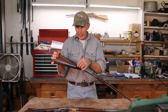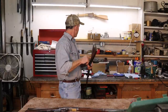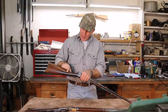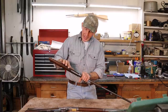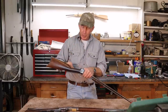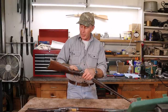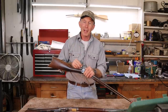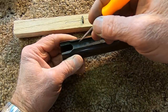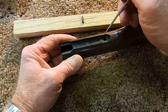One side of the crack was slightly higher than the other because of some old resin in there, so we had to go back and wet sand with Timberlux - that's a fairly new finishing product I've really fallen in love with. I just wet sanded with the Timberlux, took that high edge off, and really matched it up well. So that's an overview of how we closed up that crack, reinforced it, and then blended it in. Then we did one coat hand finish of Timberlux over the top, and this thing looks just like it did when Elliot McKeever had it back in the 1930s and 40s. We've got three dowels going in different directions and one screw from the front, epoxied and cleaned up in the channel. This is a repair that I can't imagine would ever fail - the wood will break before the repair would.